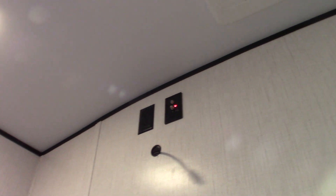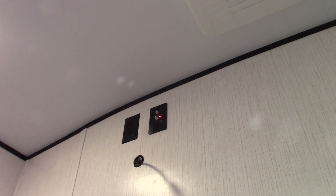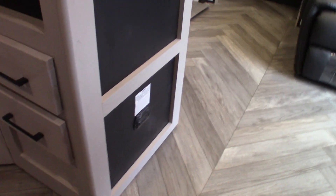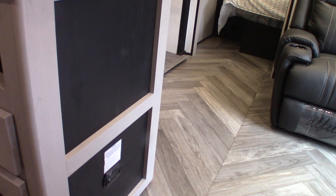Your thermostat works like any thermostat — hit the mode button to light it up and cycle through to the mode you want. This is where a TV would hook up. That red glowing LED should always be on — there's a little button next to it to shut it off, but you always want it on because that shows your digital antenna and signal booster are active. This is your carbon monoxide and LP gas detector — it should always be green. If it goes off, take everybody outside, leave the door open, shut the appliances off, shut the gas off out front, and figure out what's going on.